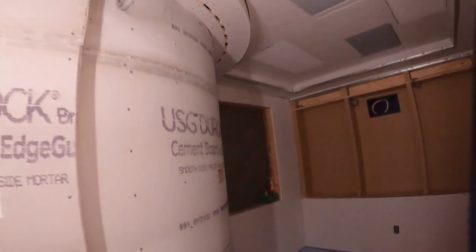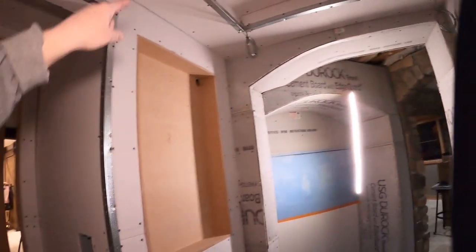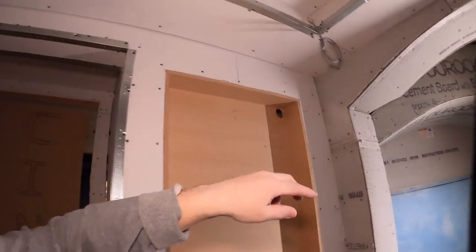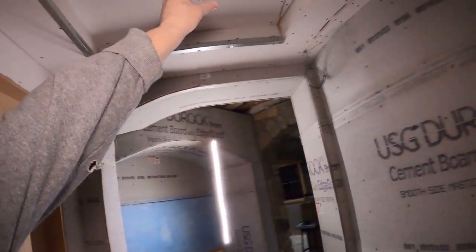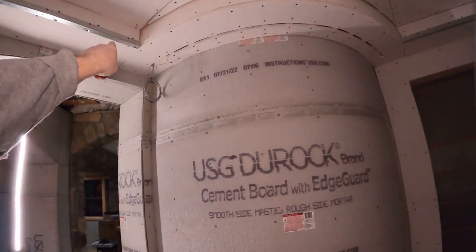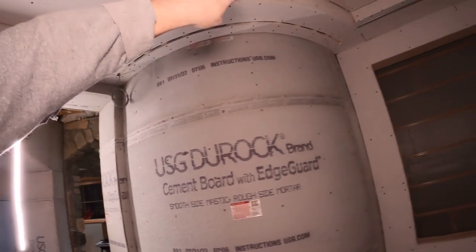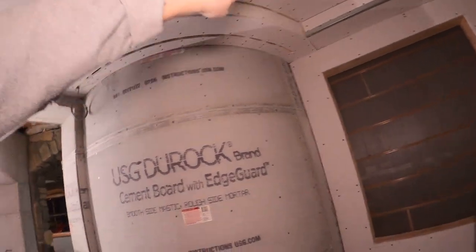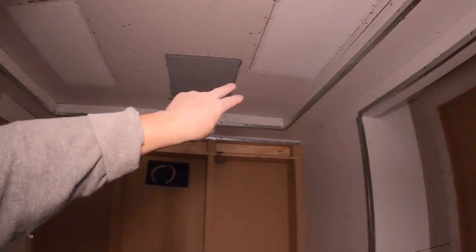Last on the ceiling, this will get a cove all the way around. It's again 18-6, and we'll bring it out and do a cove all the way around. When I did the drywall curve, I saved the MDF templates, so I have a complete, perfect MDF template of that outside corner to make the cove. This will all get RGBW lighting in it.